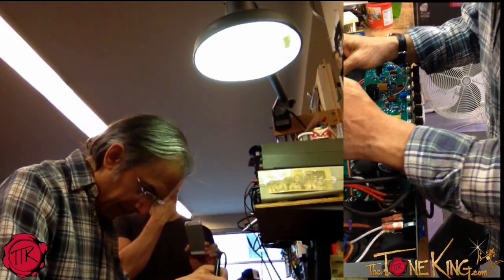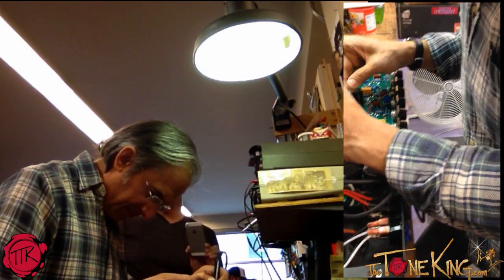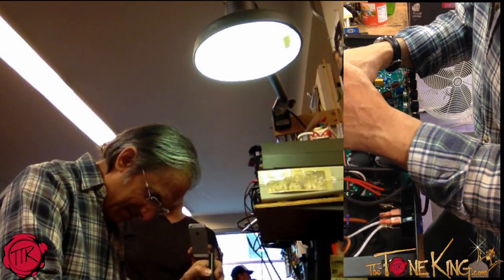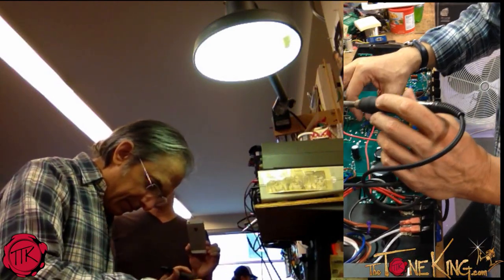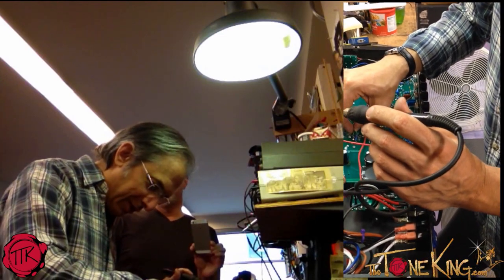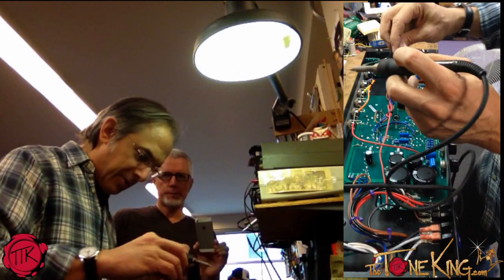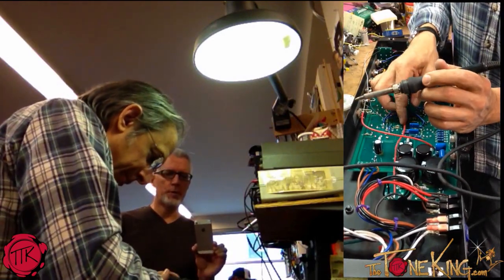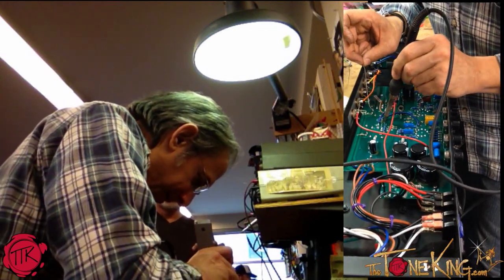Would it still be running 50 watts? Yes, unless we raise the plate voltage - the tube is capable of much more than that, but within the confines of what we have for a power supply, it's not going to do it. You know how on your Hot Rod 25 the output tube is a 5881? You're supplying it with less voltage than it can handle, and that's why it's only putting out 25 watts. That same amp, if I just changed the voltage on the plates of the power tubes, it would put out 50 watts, because two 5881s will make 50 watts all day long - if you were using a different transformer.